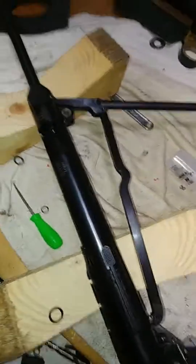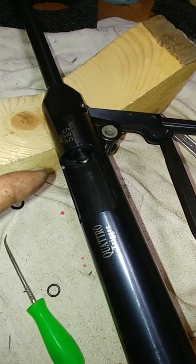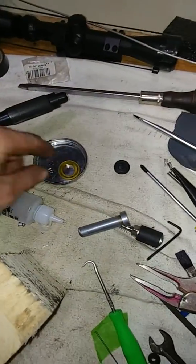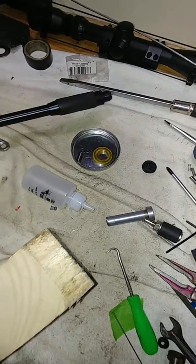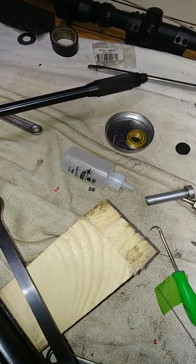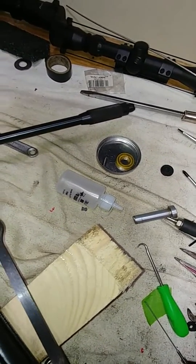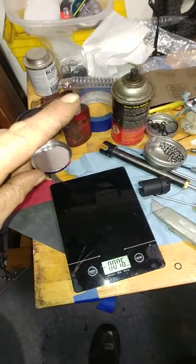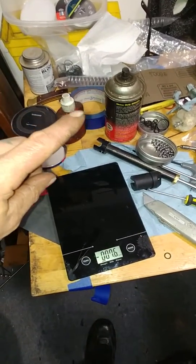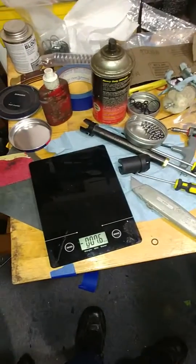You can see it is going right up against there. There is no safety on this at the moment so I do have to be careful. I took the new seal off thinking I had too much drag on it. I put the old seal back on, cleaned it up with some thousand-grit sandpaper with some oil, made sure it was nice and smooth with no nicks — which there were none. I then took the tube and pushed down on the piston, about two pounds, and it was pretty smooth.